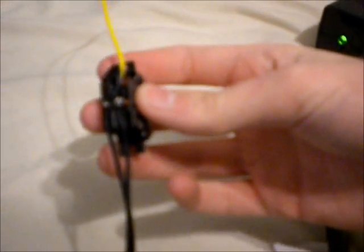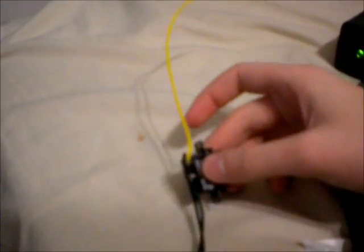Okay, I'm back and here's what I was saying. See how it's a yellow light when the switch is turned off? Now when I flick the switch to on, it turns green. So now I have my 12-volt output going and my 5-volt line is live. Make sure your 5-volt output is on the same side as your power OK on the same pin, so that you don't have 5 volts coming out until it's green.